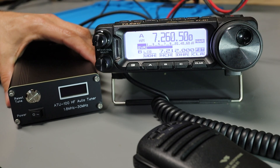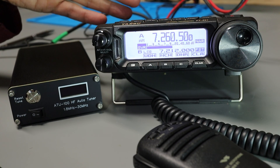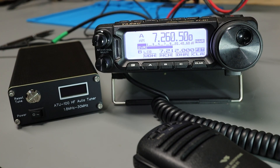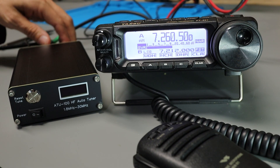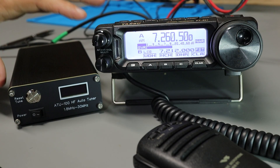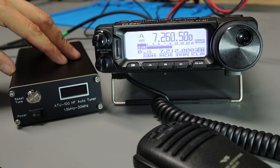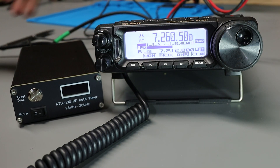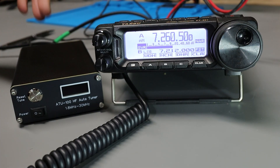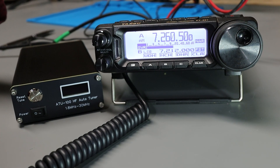The first thing I want to show you is that when the tuner is completely off, it's in sort of bypass mode. That means if your antenna is already cut for the band you're working on — like mine is on 40 meters — you can leave the tuner off and it'll just transmit through without a problem. There's probably some insertion loss, but I encourage you to check the specs. I don't recommend leaving the tuner in line if you don't need it. The radio is currently on 40 meters in AM mode, putting out about 10 watts.